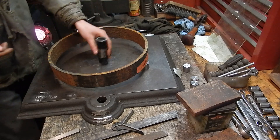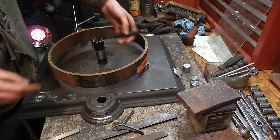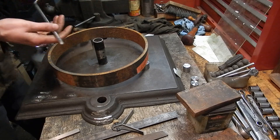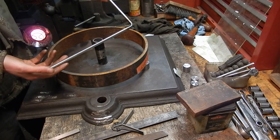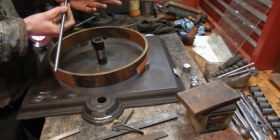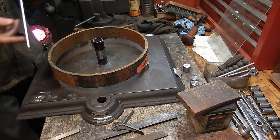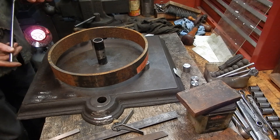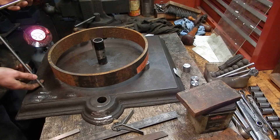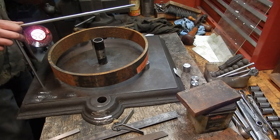Now how do I deal with the hub and the spokes? What Shop Dog Sam did — and I copied — is these very simple clamps. It's a bent piece of round stock, bent slightly less than 90 degrees. I drilled a hole in the plate just a couple thou bigger than the rod, so it just barely fits and binds up easily if it gets out of alignment — which is the point.